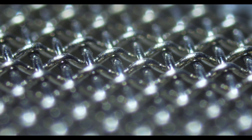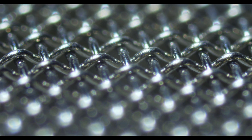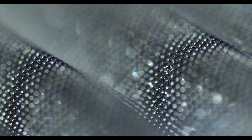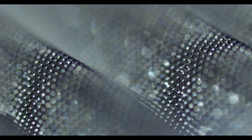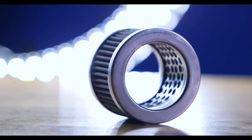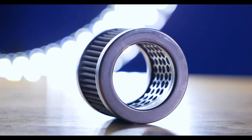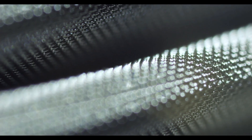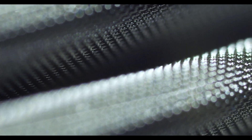With any material, contouring the shape into pleats can change the aperture structure. If you don't have a highly controlled process, this can create uneven pore sizes in your filter. Pleating is also an added process, so a pleated filter will be more costly than a filter of the same diameter if you're using the same material. You're going to use more material for a product of the same diameter, so if the material used is a premium, you could considerably increase the cost of that filter. But some multi-layer materials don't pleat well, so not every filter media will be available in your filter design.